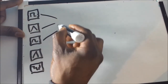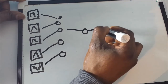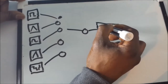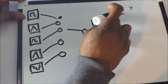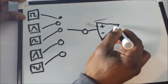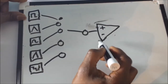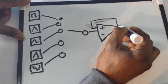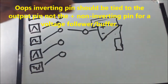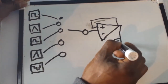We'll send all those outputs — there are a couple of ways to do this. We could send this to one op-amp, go straight in, and again just have the buffer, going straight into the non-inverting side so we're not flipping the signal. Then we go into that buffer and send that via a resistor. For unity gain — exactly the amplitude going in comes out but in inverted phase.